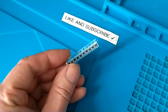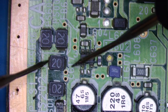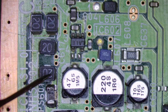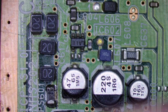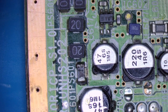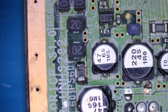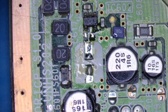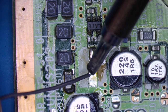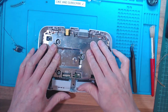Two months it's taken these to arrive. There's no continuity on this bottom fuse, so I'm hoping to take this off and pop a new fuse on, and I'm hoping that'll give me the voltage to the optical drive that I'm looking for. I'll take that cap off first to get it out of the way of the hot air. I'm hoping that fuse has fixed it - disc in.